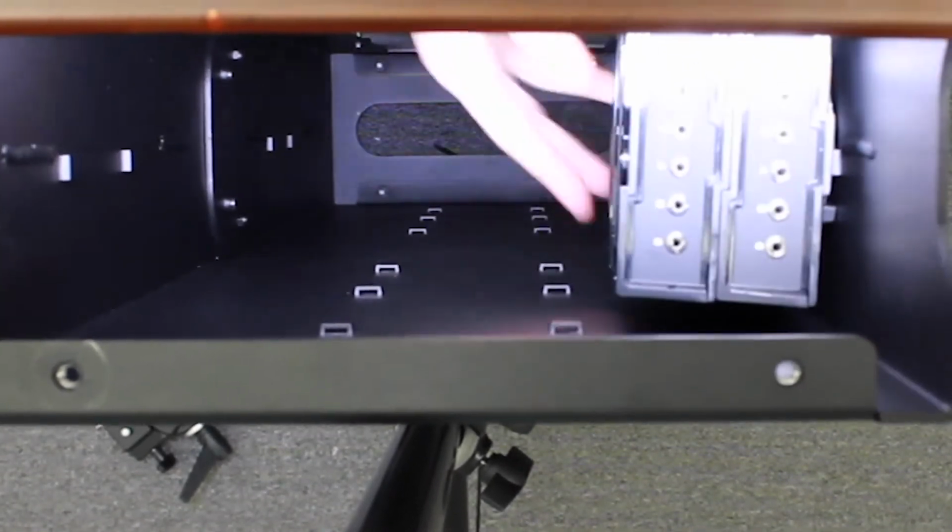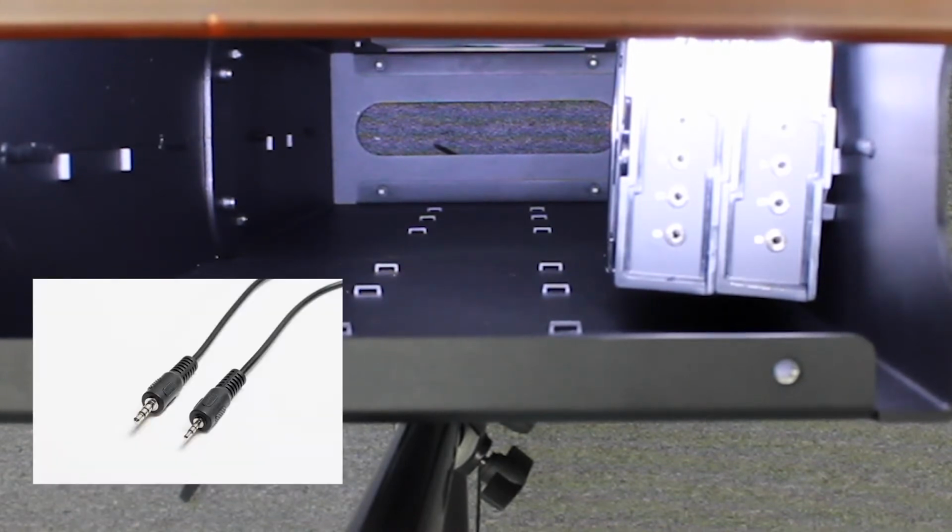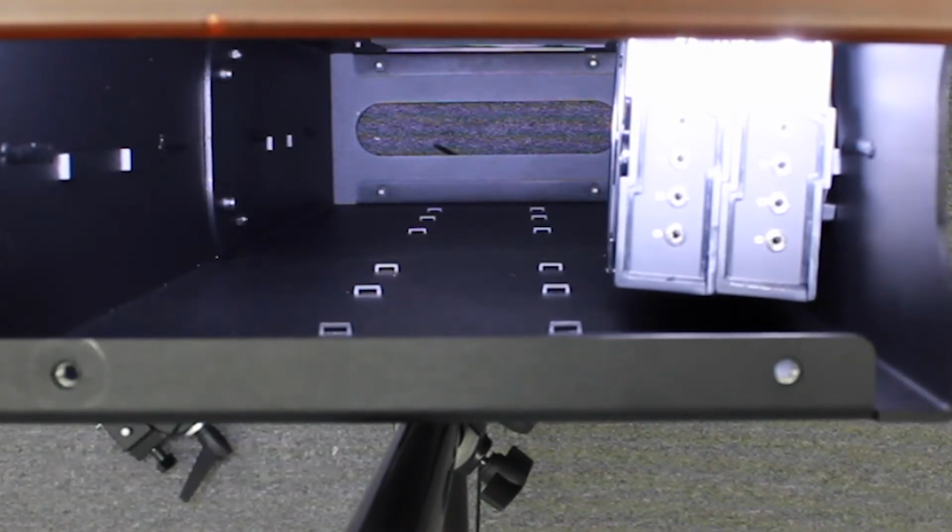On the Esper boxes themselves, there are six ports, ports 1 through 5 on the first one, which is the one touching the left side of the booth. Those are going to be used for the sync ports, and then port 6 is going to be used for the flash. Ports 1 through 5 are using 2.5mm to 3.5mm ends, and then port 6 is a 3.5 to 3.5mm aux cord.